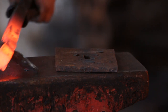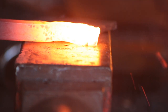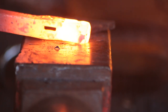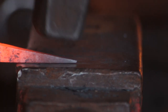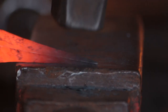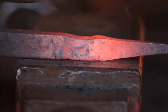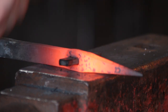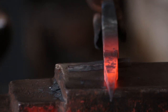Before we sort that out I'm going to draw out this taper on the inch and a half mark. That section will be marked up at an inch and a half from the bottom of the bar and we're going to draw out to three inches in length. Start off with your cross-peen then move on to the flat face of your hammer to clean it up. I do kind of wish I'd given myself two inches rather than an inch and a half. With that taper drawn out I'm then going to bang the drift back in there and using the cross-peen I'm going to spread those cheeks out so I end up with a 20mm wide square bar again.